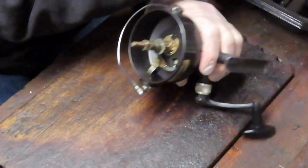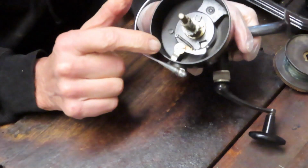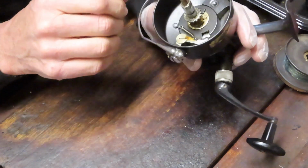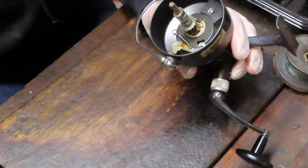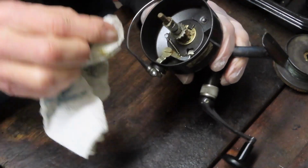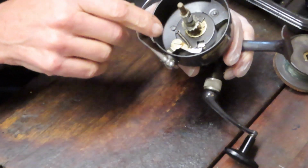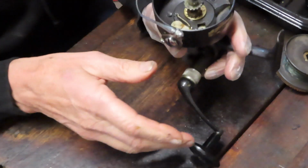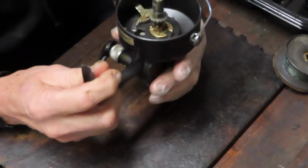And underneath is fairly uncomplicated. We have an axle shaft, we have a trip lever, and we have a tie down for our rotor. There's a little bit of old grease on there. We're going to be taking that rotor off anyway. We'll clean up the old grease. We'll make sure that these pieces and parts get oiled, and we'll do that in the reassembly process as well.